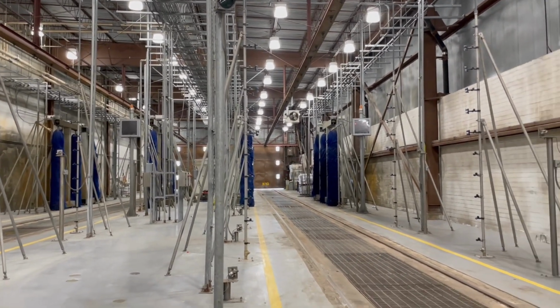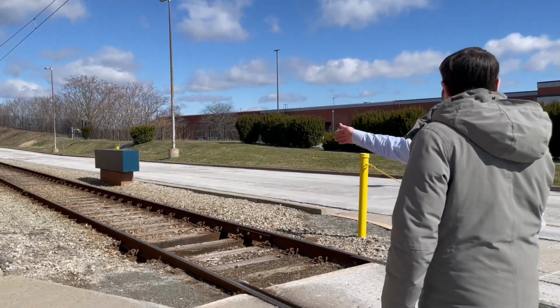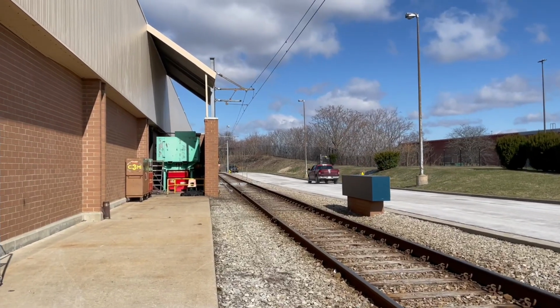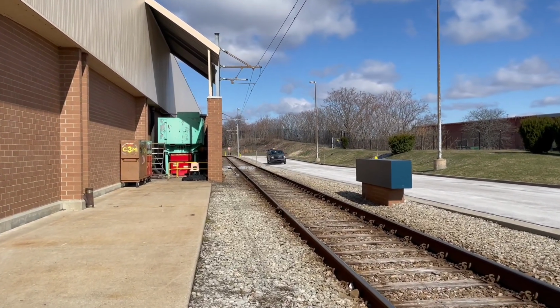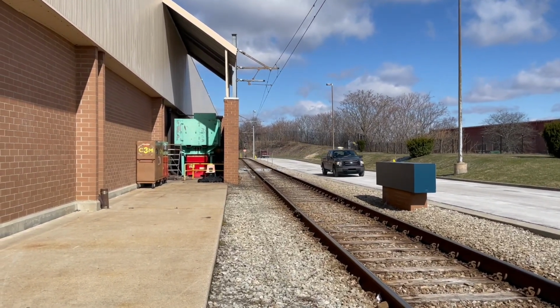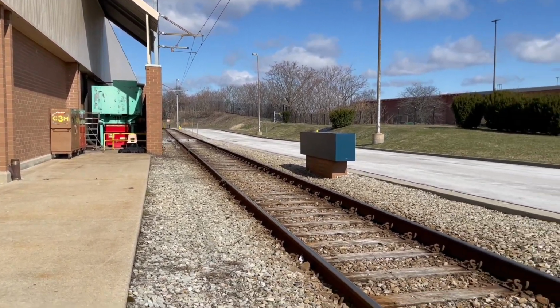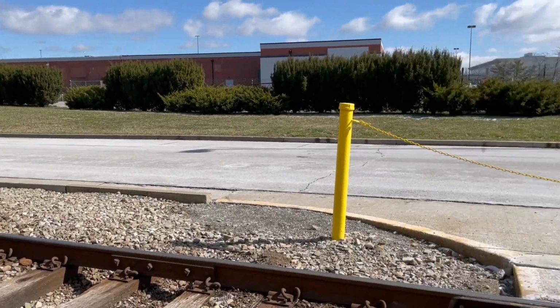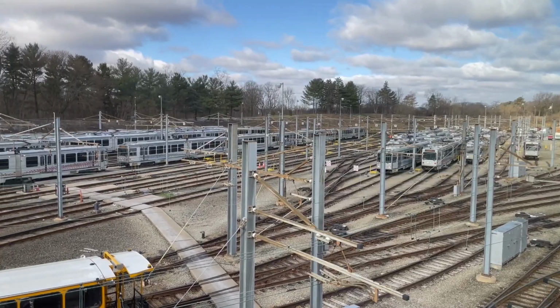Yeah. One last thing I'd like to show you is our wayside measuring device. When every car comes back from morning revenue service, this is called our TT track, and they will ride over the top of that silver box in the tracks. There are lasers that take 6 different measurements of the wheels and put it into a database. So every day I will know how the wheels are wearing, and hopefully trend analysis to know when the next time it will need replaced. Oh, wow, that's amazing. So you can just see, okay, we should start scheduling this one for a few months out or whatever.